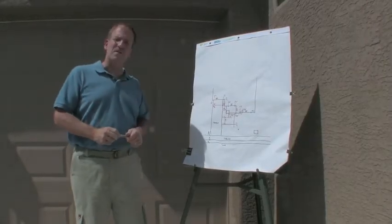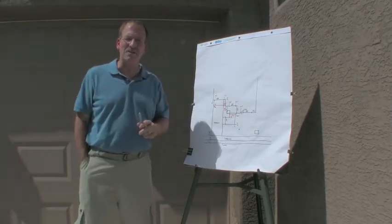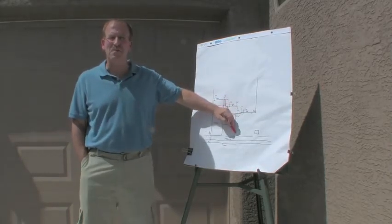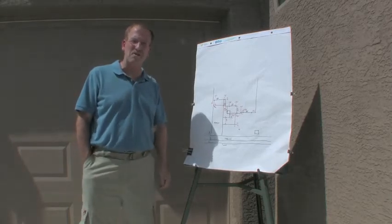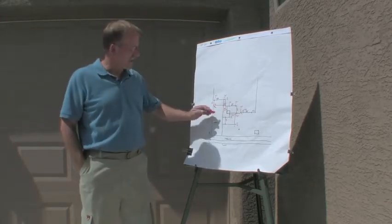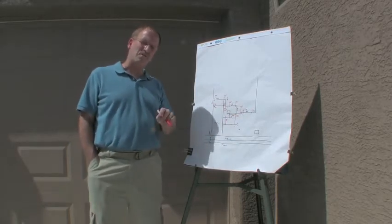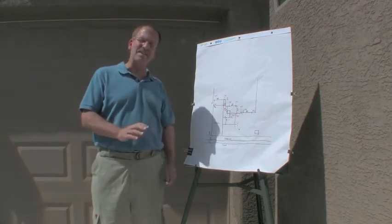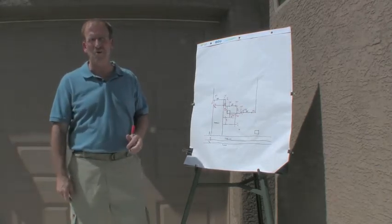Now we're going to record those dimensions on the plan here. But first I want to mention, some of you probably caught that I gave a dimension of 13.3 and I told you earlier to stick with plus or minus 2 inches. There's a reason for this. It's because with the triangulation method, it's very important that you get the exact distance. So in these cases, I would get at least to the inch, maybe to the half an inch if it really matters where the item is located.